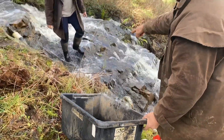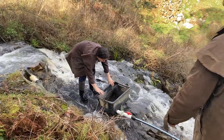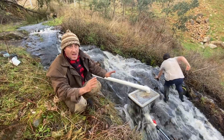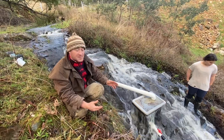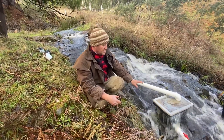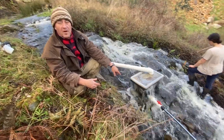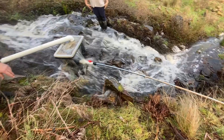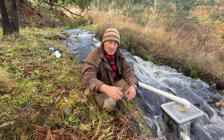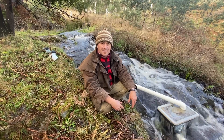It's connected — nothing's been permanent here, we just want to make sure things can naturally give us what we want. We've just started going into the tub. What we've done is put a massive big rock in there just to hold it in, plus the weight of the water. I've got the inch and a quarter water pipe connected, so I've got to now see where that will be further down, connect the pressure gauge, and then we can start measuring some volume, looking at some pressure, and come back up to check some elevations and height.